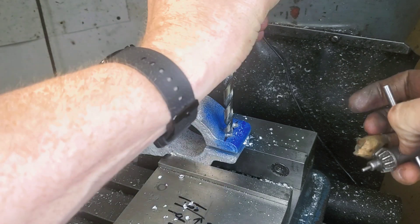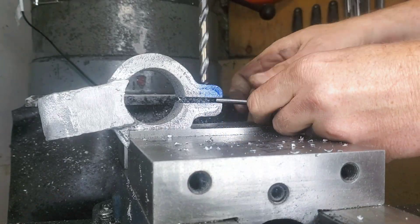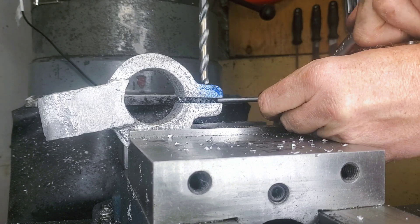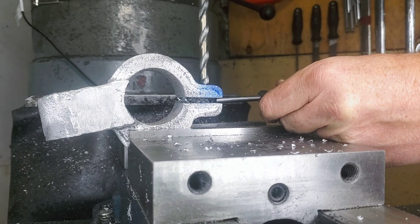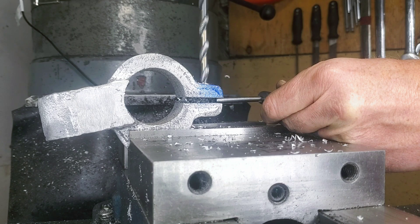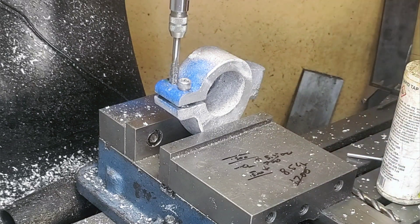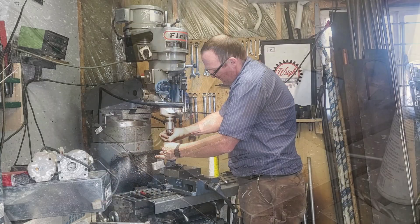What I'm doing here is I measure the outside of those threads, and the top portion — the one you see painted blue — we're just going to drill halfway through that. We're not going to drill all the way through. This is our clearance for our threads. I made sure it was super tight, because if I tap this by hand, my tap is going to be absolutely perfect, perpendicular to where we're tapping, and it's going to be super easy to tap.